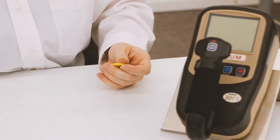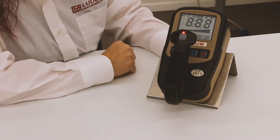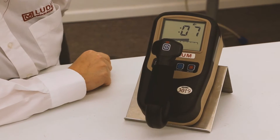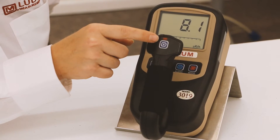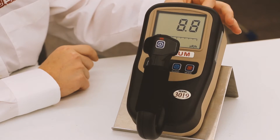The next micro R meter we'll be comparing is the Model 3019. When we turn it on, it will show the battery voltage on startup and then take an 8-second sigma count for background. Anytime readings increase two sigma over background, this light will flash and you will get an audio indication.